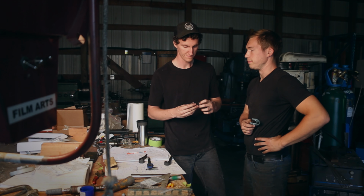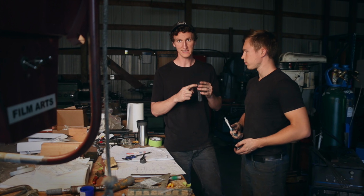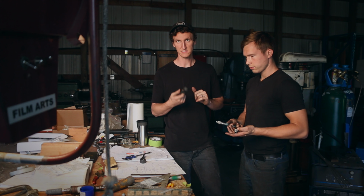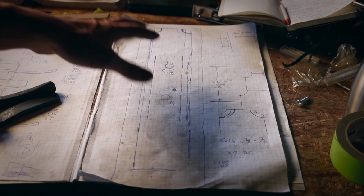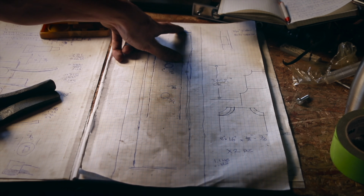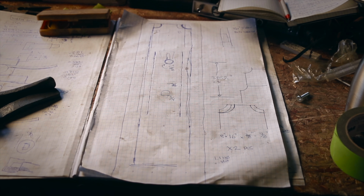So our plan is that Martin's going to remachine this part here to match the spec of this hole because it's oversized, because we can't remake this, or it's easier to remake that than it is to do that. So that's our game plan. While we're getting our life sorted out on these parts, I'm going to jump on and start working on the base here. So I'm going to make a curved chisel up, because I don't have one, to hopefully notch that out, and then make the plate, texture it, cut it off. Super quick, here we go.